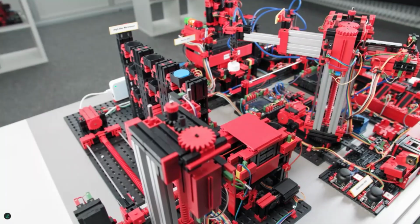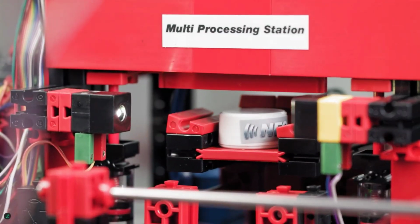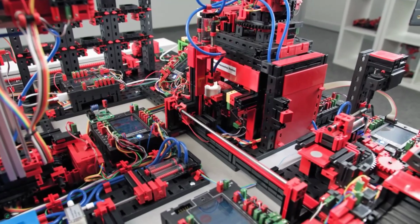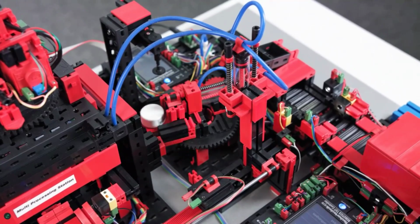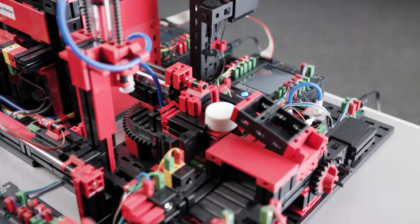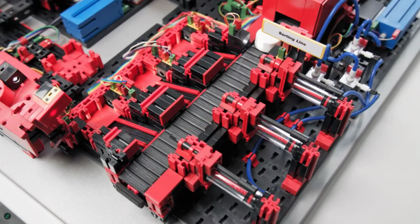Customer-specific production takes place in lot size 1. The production process is simulated in 2 steps. The suction gripper passes the material on from one step to the next. The material is transferred to the sorting system once production is complete. The sorting system receives the allocation command as soon as the color sorter detects the proper color.